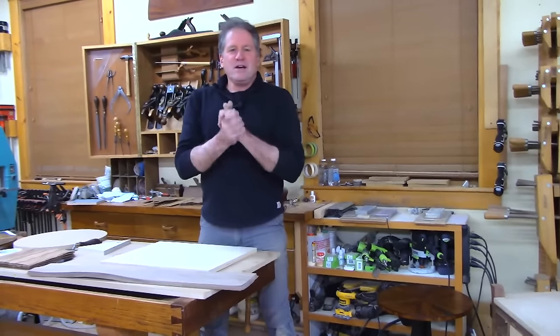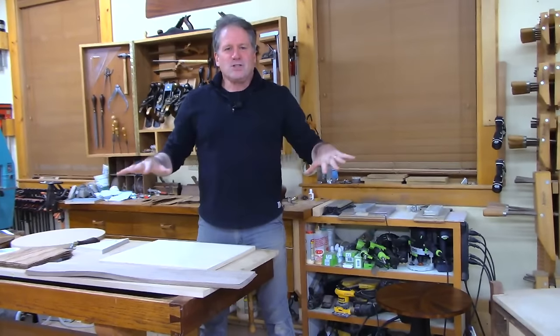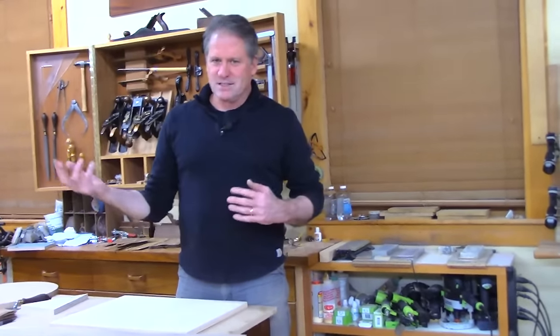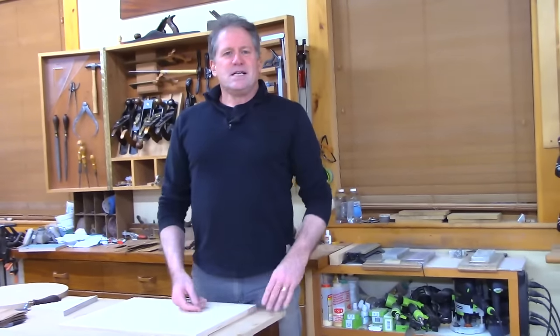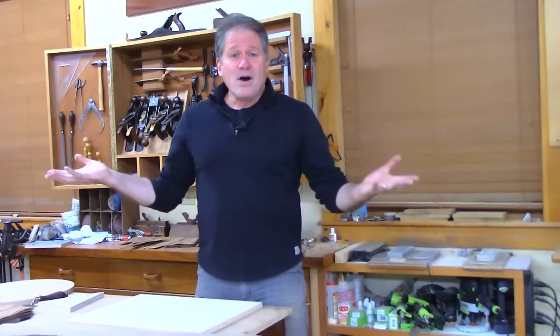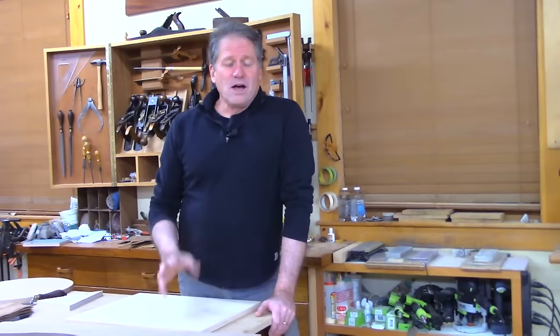Tonight I want to talk about veneer — and it's not cheap in the way of cheap furniture if you make something out of veneer. Veneer's got a bad name, mostly because of the poor manufacturing practices of the early 1900s. A lot of us have seen Singer sewing machines with the veneer popping off — because it was applied to hardwood at cross angles over an unstable substrate. Some of the most beautiful and valuable pieces of furniture in the world today are actually made mostly with veneer.